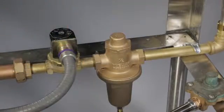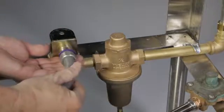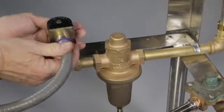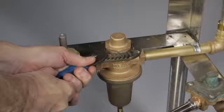To disassemble and service the pressure regulator, it is best to remove the fill valve coil. The pressure regulator is on the downflow side of the fill valve, therefore turning off the water supply during service is optional. If water flows during service, the fill valve diaphragm and plunger should be inspected. Restricted or uncontrollable water flow is caused by the regulator seat washer failing.